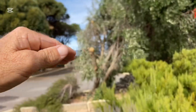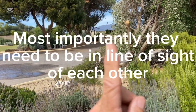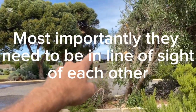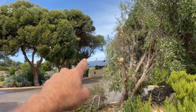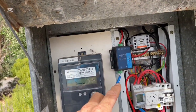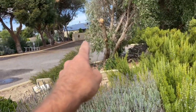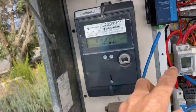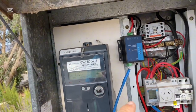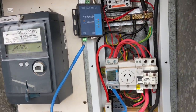For this particular product, the antennas need to be within eight metres horizontally of each other, and they also need to be perpendicular — one can't be angled one way while the other is angled differently, because the signal's not going to reach. As it turns out, the antenna on the shed down the other side was just a standard antenna — it wasn't strong enough. So I rang Integralec and got some support from them. Ultimately, I ran an external cable from here all the way back to the shed just to determine what was actually faulty, because I didn't know if it was the energy meter or the wireless bridge. Both are relatively expensive devices, and I'm about an hour away from site here — two-hour round trip — so it gets expensive if I'm going back and forth.